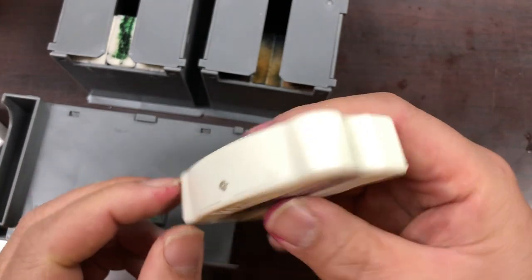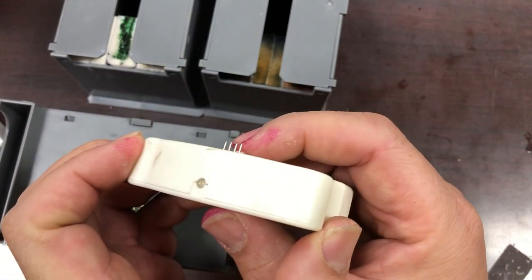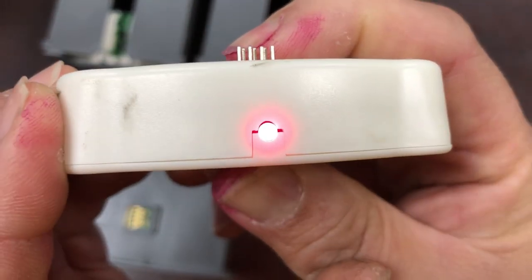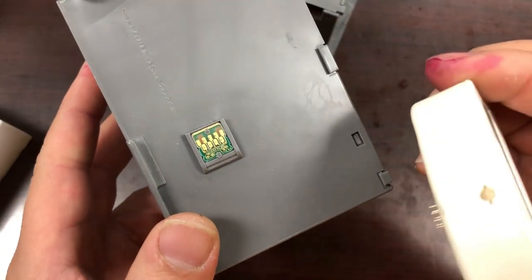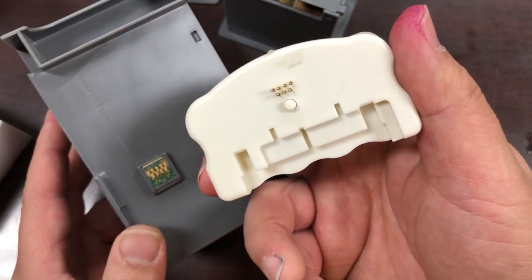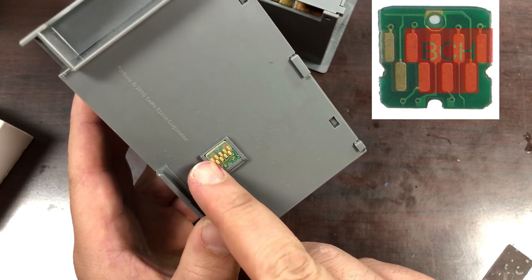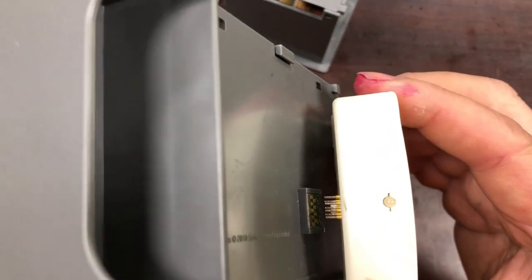This little thing is triggered when the resetter puts electricity on the pin — so when you push, it will light up. Because now it cannot reset, it ends up with a red light. There are five pins on top and four pins on the bottom on the resetter. The trick is you skip the first pin, so the top left pin will never be used, and the bottom left pin will not be used. You line up to the right.